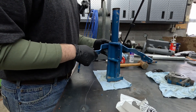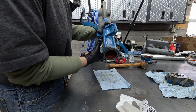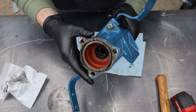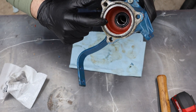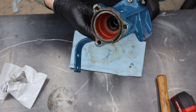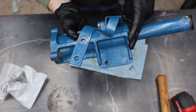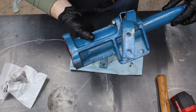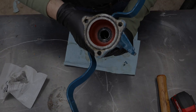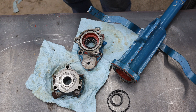So that is how you put new seals and O-rings into a Ford 3000 steering column. If you turn the wheel hard, build up pressure, and get oil leaking out of your Ford 3000, it's probably these seals and O-rings. When I would turn the wheel hard, it would just pour out on the gearbox and on my feet. When I pulled this part, the upper part of the shaft housing was completely full of oil — which means this inner seal had failed. There's all of our assembled pieces. Thanks for watching.